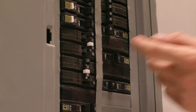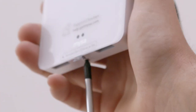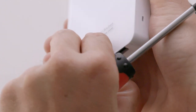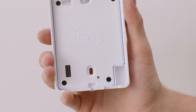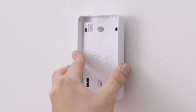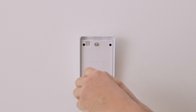Go back to the electrical panel and turn off the breaker again. Loosen the screws on the bottom of the faceplate and remove it to access the mounting screw holes. Pro tip: to avoid potentially dropping and losing your set screw — those things are small — ensure that you don't back your set screw out all the way. Next, carefully place your wired Mesa into the gang box. Start with the wires and be gentle — you don't want to loosen any wire nut connections. Loose connections can lead to problems like error codes.